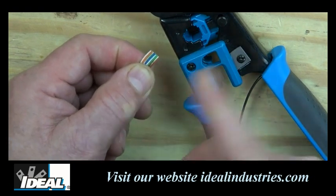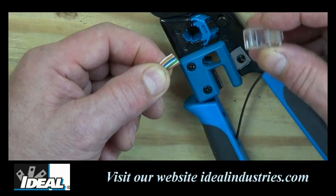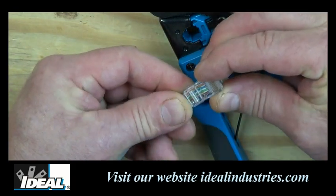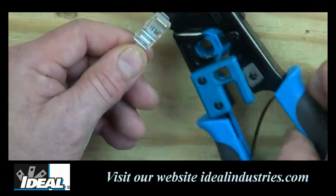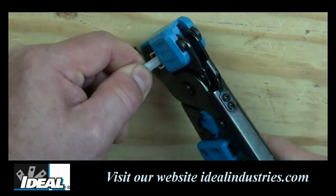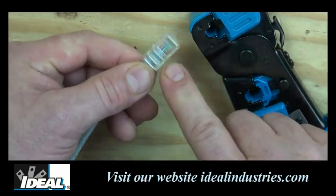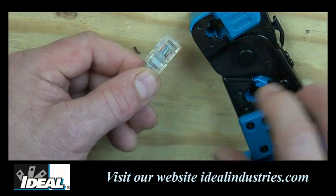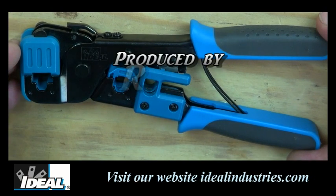For an RJ45, you'll need a piece of prepped wire — watch my YouTube video on terminating modular plugs for data circuits if you need to learn how. In this case, have the white-orange wire on your left with the gold pins facing you, and insert the wires all the way through the connector. Load it into the front die nest, make sure the wire is bottomed out, and squeeze the tool all the way down. That crimps all the pins and strain relief — and there's a properly terminated RJ45 modular plug for data circuits. That's the Ideal 30-496 Telemaster tool.